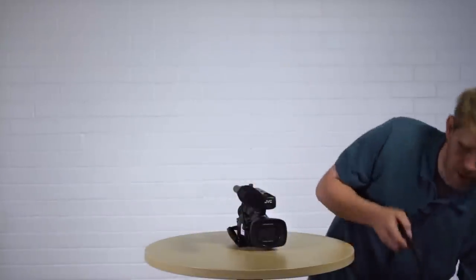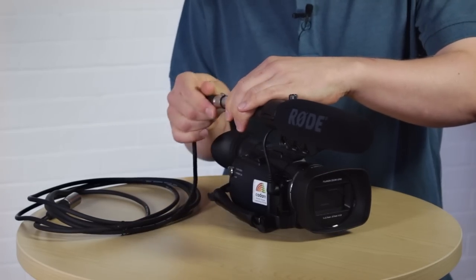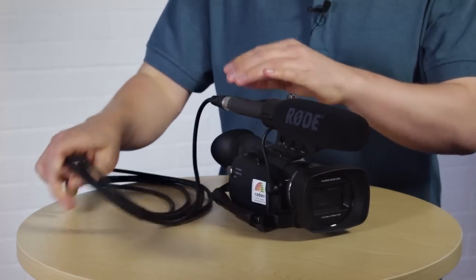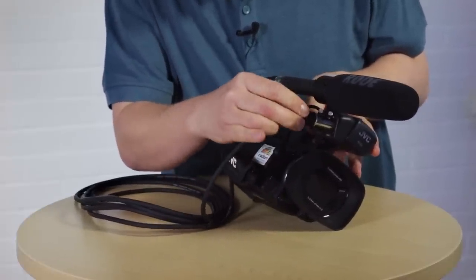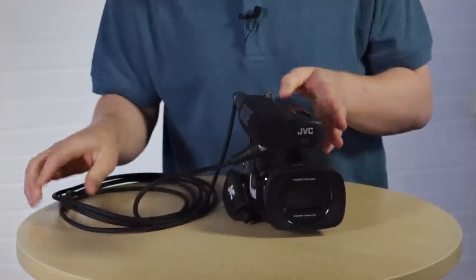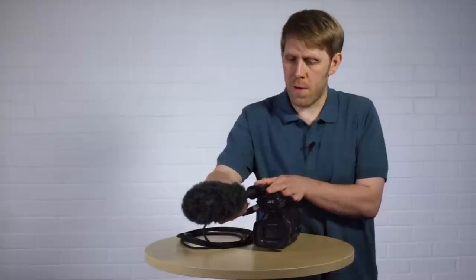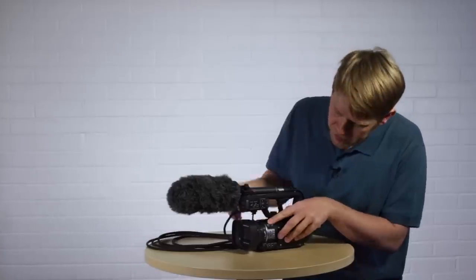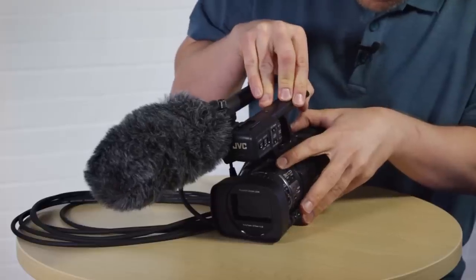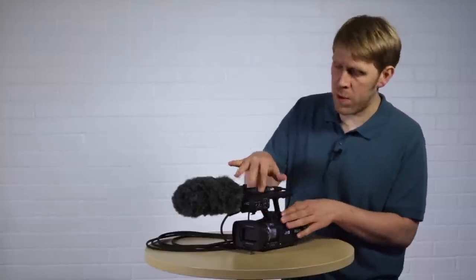To connect a microphone, you need an XLR cable. Plug the female end into the microphone and the male end into input one until it clicks into place. If you're filming outside, you can put on a windshield, but be aware that it will almost certainly appear in your shot. It's also worth noting that there's a very basic stereo microphone on top of the camera behind the lens — while it won't give you the best sound, it's useful to know it's there in case you find yourself struggling with the audio unit and microphones.